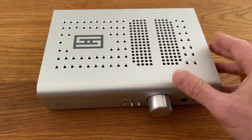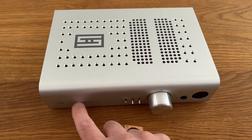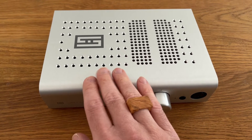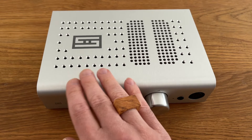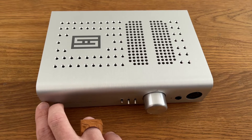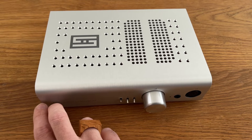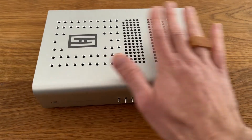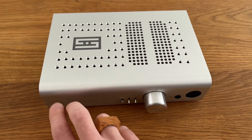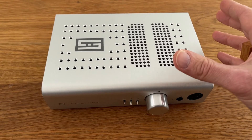One thing you can do — what I did — is open it up and install several copper heatsinks. According to my thermal heat-sensing camera, two transistors on the far left of the board have the highest heat generation. The rest has an overall similar heat signature.